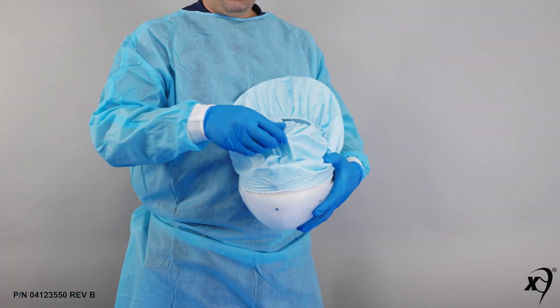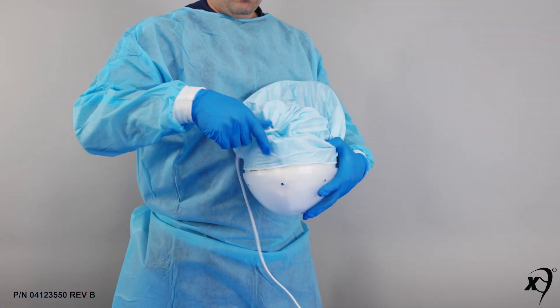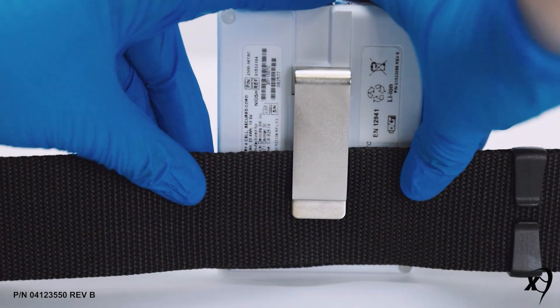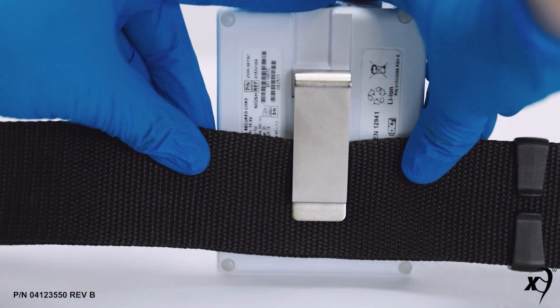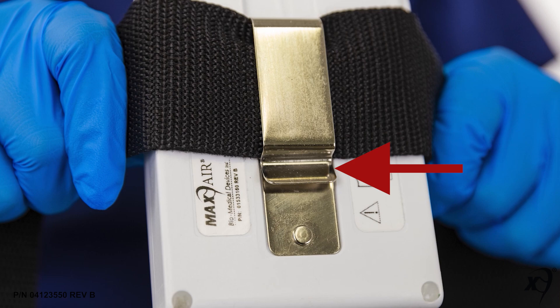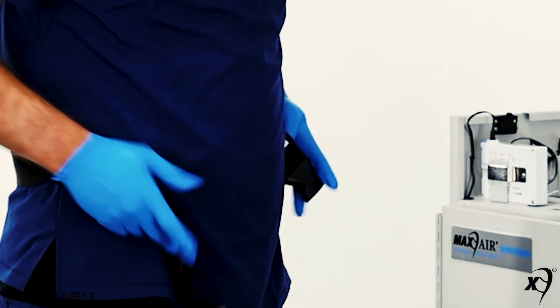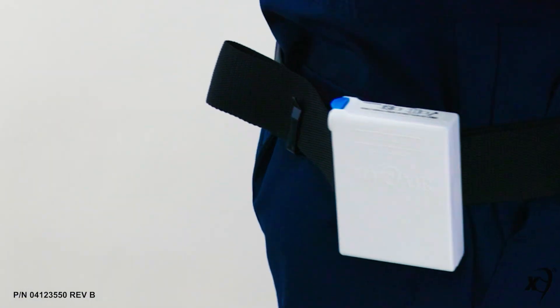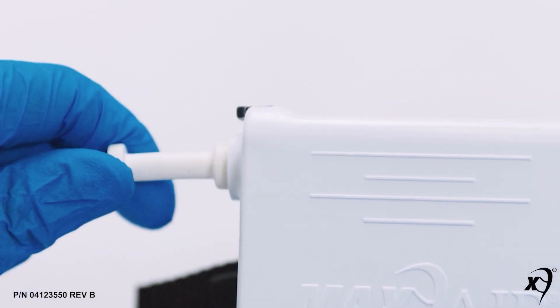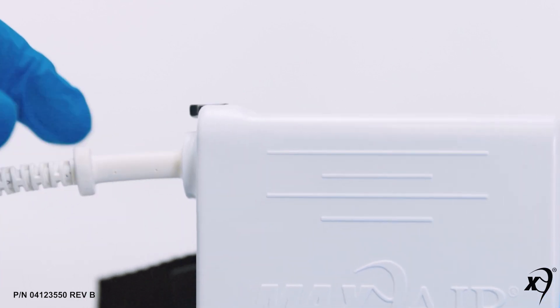Pull the helmet battery power cord connector through the back gaiter button hole from inside the gaiter to the outside. To don and assemble the battery, place the top edge of the belt under the battery clip and up to the top of the clip so the clip detent rests on the clip metal to metal. Place the belt comfortably around the waist with the battery near the side back of the right hip. Push the power cord connector into the battery receptacle until the secure connection audibly clicks.